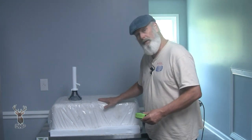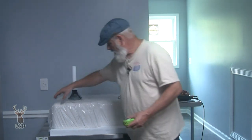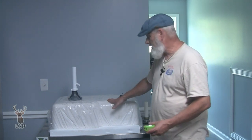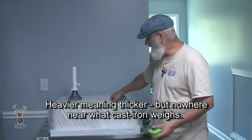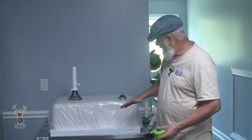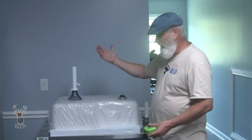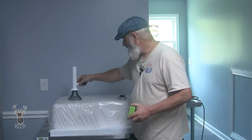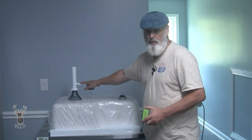This is actually a very nice tub — a fully radius, nice rounded corner, drawn one-piece sink. It's 16 gauge, which is heavier than 18, and less likely to ding. It has sound deadening and reinforcement on the bottom. It has a draft that goes up toward the drain. I have a dishwasher right next to it, which requires a tailpiece with a dishwasher port.